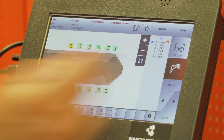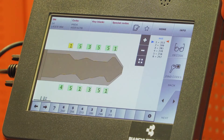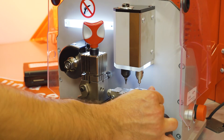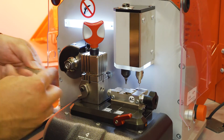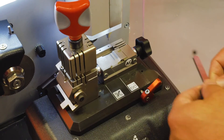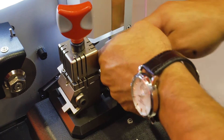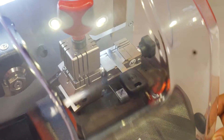Select Find Codes — and there's your key code. Once the key has been decoded, you're going to move the AC jaw over to the cutting position. Insert your tip stop onto the zero position. Take your new key blank and lock it into the AC jaw.